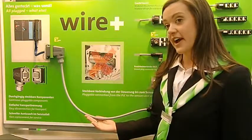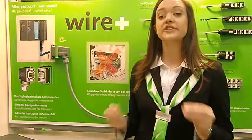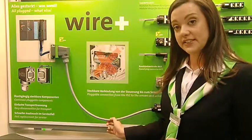Now we'll present to you an additional solution to connect the passive distribution boxes directly to the PLC through the cabinet. Now you can order all Murrelektronik D boxes, caps, or M23 plugs with a pre-wired Wire Plus. The cable length can be specified in half meters and can go to a max length of 30 meters, so your cable fits your machine perfectly. Wire Plus is robust, but it also is light and it's IP65 sealed.